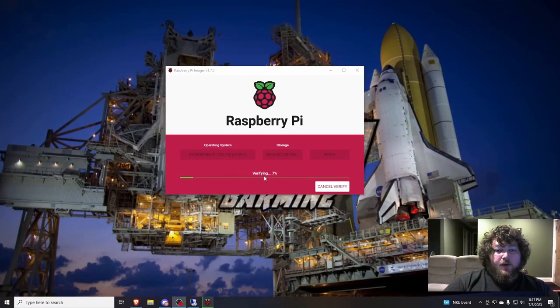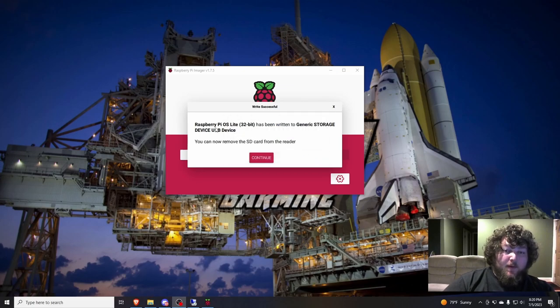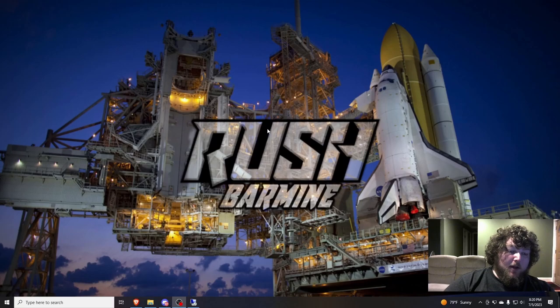The writing process is now done and it's on the verifying process. After it writes the OS to the SD card, it comes back through and verifies all the files. After it's all done, you'll get a few pop-ups on Windows — it might show up as a couple of different partitions. Just click cancel, and the Raspberry Pi Imager will tell you we're all good and it's safe to remove. Now I'm going to eject the SD card and put it in the Raspberry Pi and power it up for the first time.